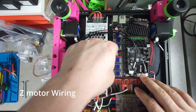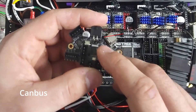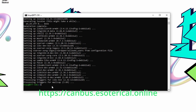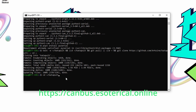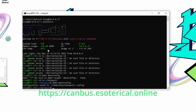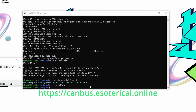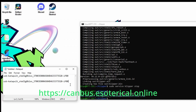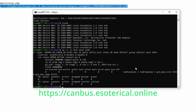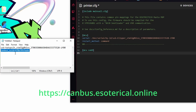This will start with the 120 ohm resistors placed on the tool head board as well as the Manta M8P. As mentioned, this is not a tutorial on the installation of CAN bus, so I will be skimming over this section. All of the commands used can be found at the website linked on screen and in the description below. Esoterical did an excellent job of doing this write-up — there is troubleshooting, configurations for most of the boards and tool head boards on the market, as well as very detailed steps to getting you up and running on CAN.